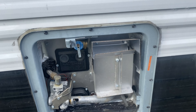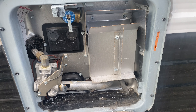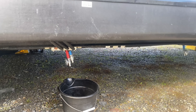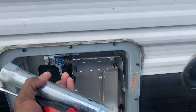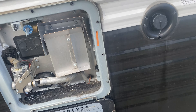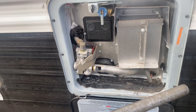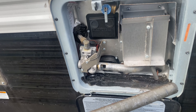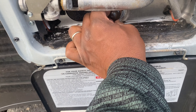Here is where you have your heating element. If your hot water heater has an anode rod, you're going to want to release the pressure and then take out the anode rod. That would release any extra water that's in your hot water tank. Once you're satisfied that it's finished draining, you're going to need an anode wrench and a screwdriver. Release the pressure first — there's nothing in there because we emptied everything out. Then use your anode wrench to remove it and inspect it. We just put this one in right before the summer so we're still good. No water coming out, so I'll put this back in, tighten it up, and we're ready for next season.